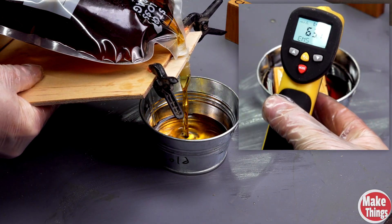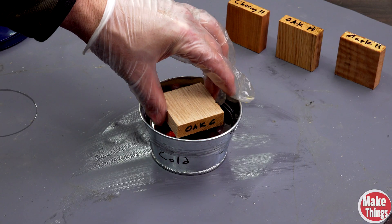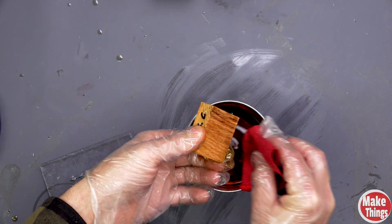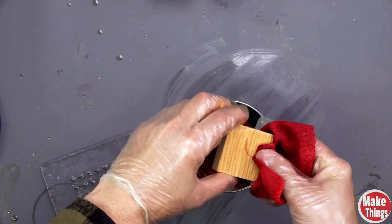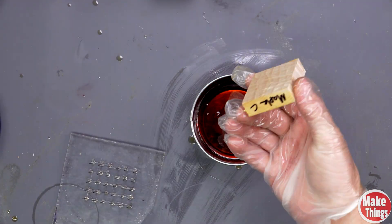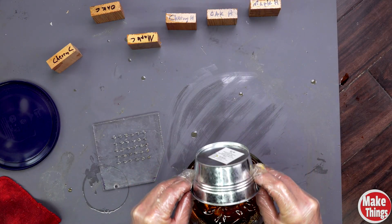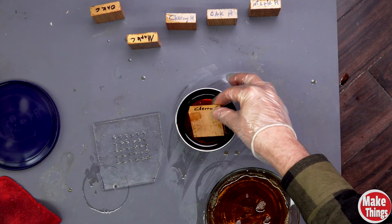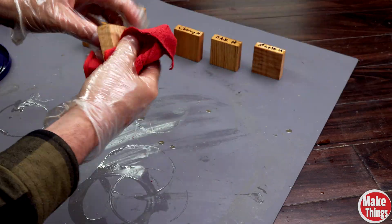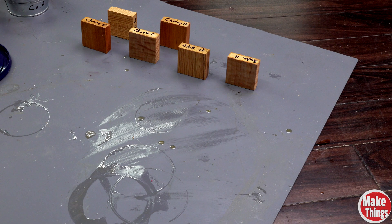With the warm samples complete, we move on to the room-temperature oil, which is just over 60°F. Right away the difference was obvious — the oil was much thicker. I added the oak sample, set the plunger in place, and ten minutes later pulled it out. I'll admit it was much easier to clean the blocks after the hot oil bath; the cool oil really sticks to the surface. After a fresh pour, maple was next, then we dumped the oil one last time and tested the final block, cherry. All samples are now wiped down and resting. About two hours in, I gave them a final wipe to remove any oil that might have wept out before letting them sit for the full 10 to 12 hours.